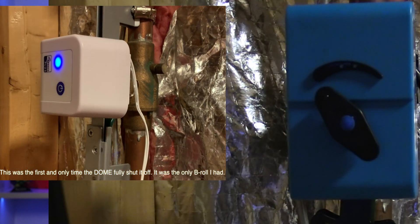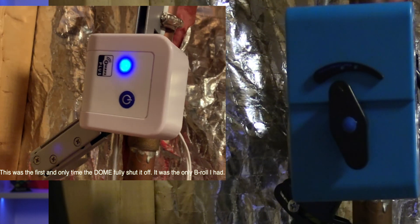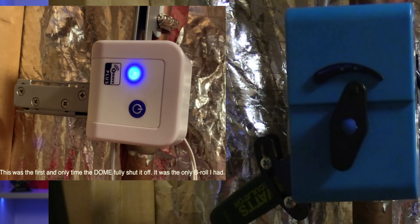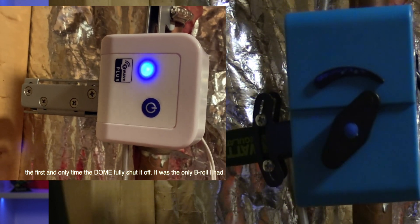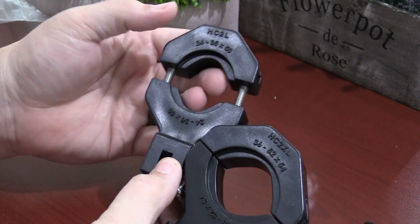Even though the Bulldog has a lot of torque, it is not the fastest. It actually took about 15 to 20 seconds to fully shut off the valve, whereas the Dome was faster but didn't have enough torque to fully close it. So I traded torque for time, and it is well worth it. When it came to installation, it's actually quite easy — it is a retrofit. You don't need a plumber; you're not breaking any pipes. It just fits right over your ball valve, and it comes with two different mounts: one for smaller ball valves and one for larger ball valves.